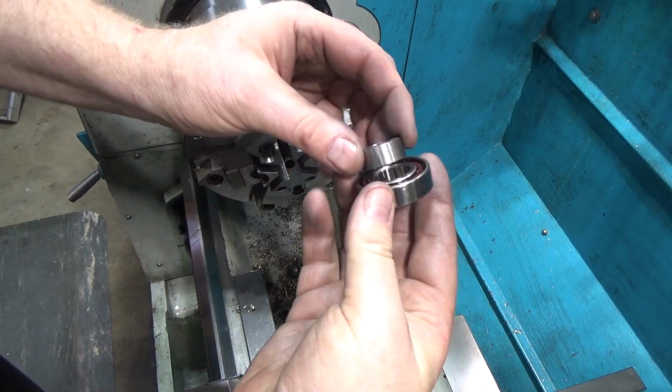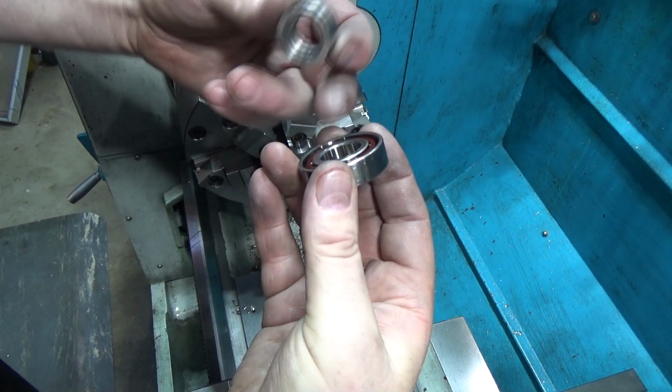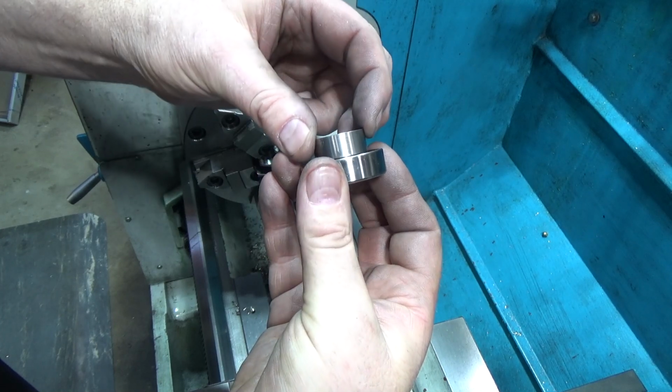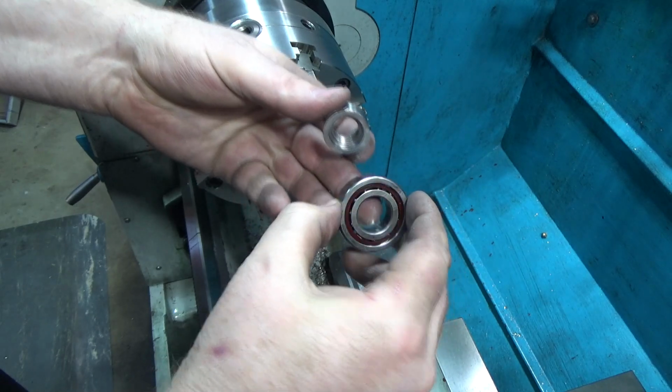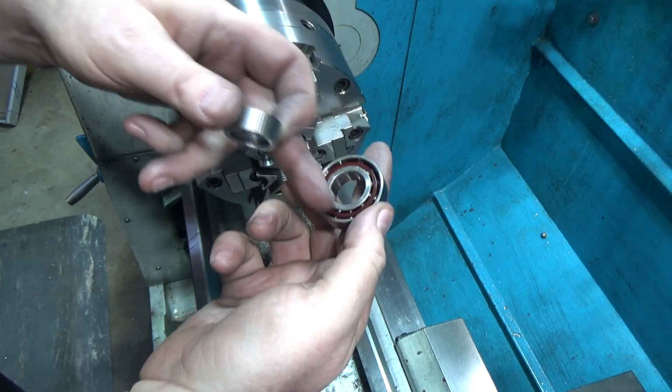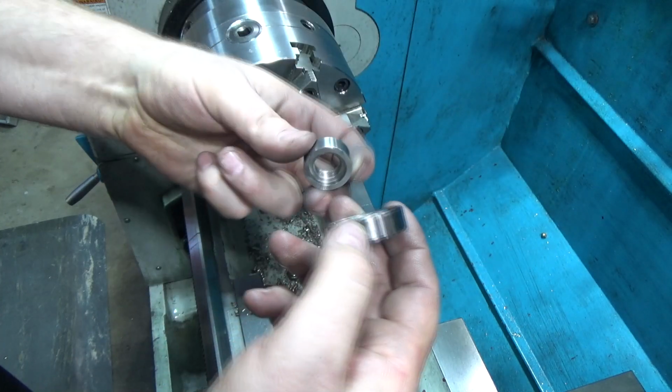And there we are. Here's the bearing, here's the preload nut. It'll fit like this, and it'll press, the threads itself will clear, and it'll press just on the outside of the race and preload in this direction, because these are taper bearings, so this side's open and you press in that way. The matching bearing goes the other direction.